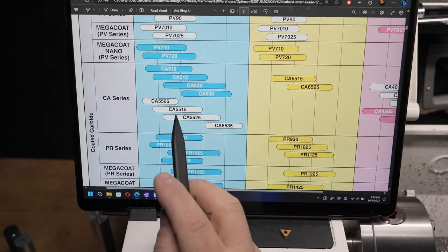That's for roughing. But they also talk about planing, which means a fine finish. And in this case, they say the infeed speed should be at the most a third of the corner radius. A third of 0.4 is 0.133. This lathe does 0.11. Clearly this lathe is designed with all of this in mind. So that 0.11 minimum infeed speed fits all of this perfectly.